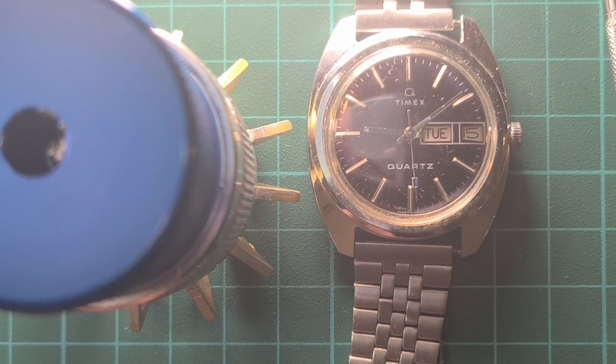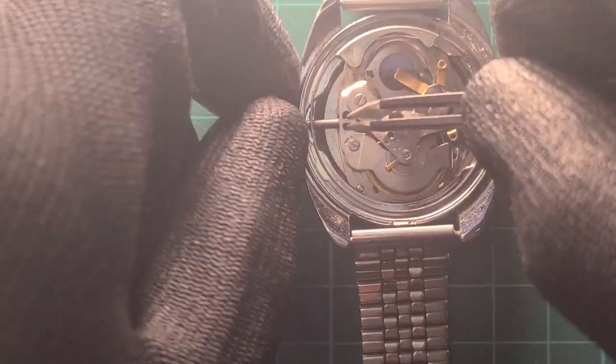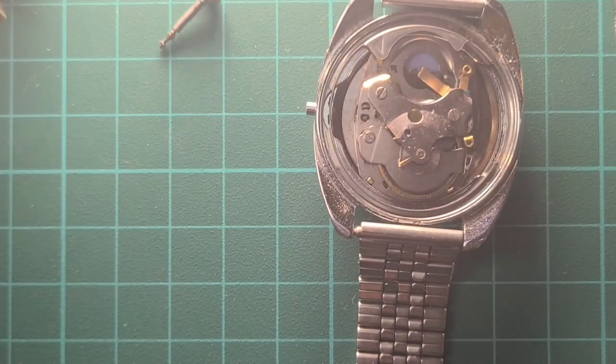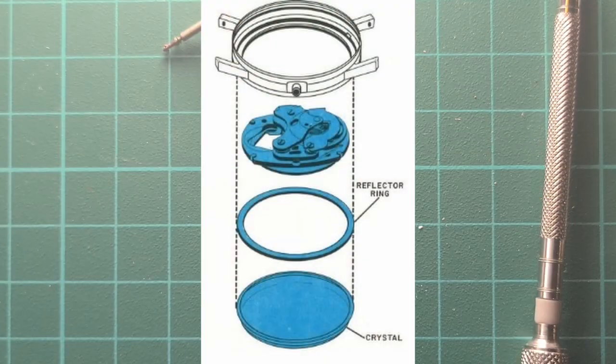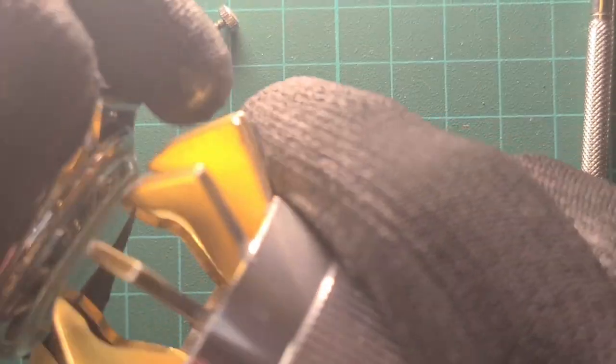Tip the second. Movement removal is through the crystal. Why do we care about the shunt bridge anyways? Well, typically it's because I find that on these electric and Dynabeat Timex watches the hairspring is perfectly okay and it is not deformed. However, there's usually a break somewhere in the coil on the balance, meaning that in order to get to replacing it, you've got to remove the shunt bridge at a minimum to replace the balance. And this is also where sometimes when people ask me questions on how to proceed with the Timex repair, I notice that they fail to do this step, and what is normally a fairly easy balance replacement now becomes something a little harder than what was expected.